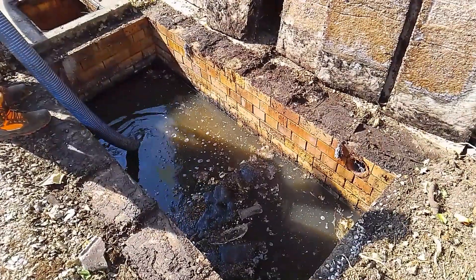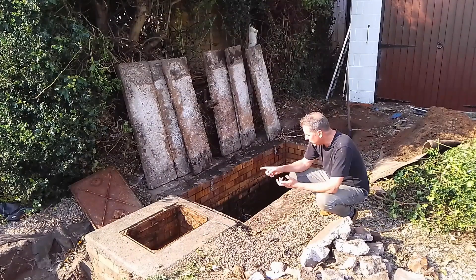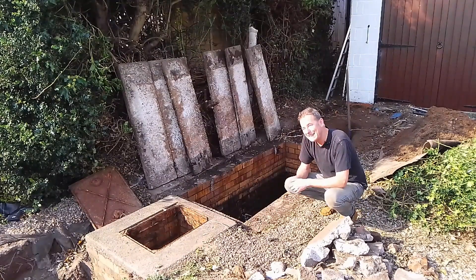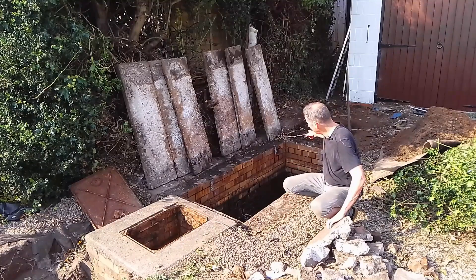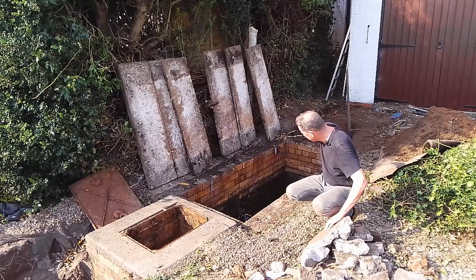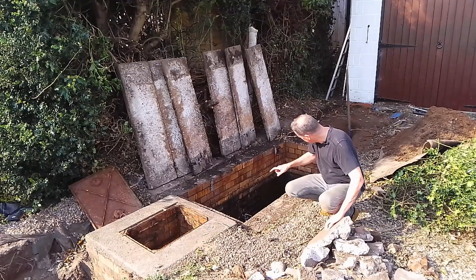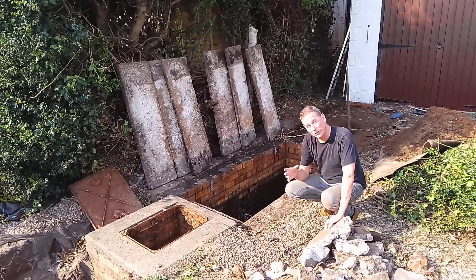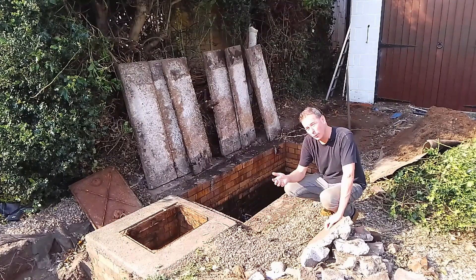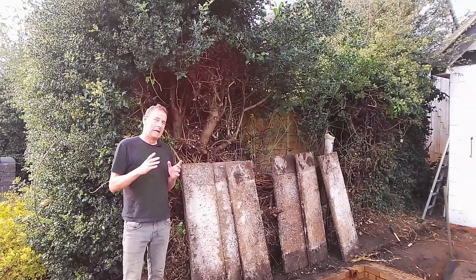Mine was filling up and I knew it because when I flushed the downstairs toilet the waste wasn't going away as quickly as it should. I took the inspection chamber lid off, lifted the concrete slabs, and realised it was filling up. That indicates there may be a problem with the soak away — the water's not going out at that end. It might mean getting a rodding company to rod the soak away, or I may have to dig the lawn up and put a new soak away in. Putting in a new soak away isn't a huge job — it just requires a mini digger.